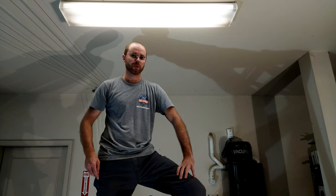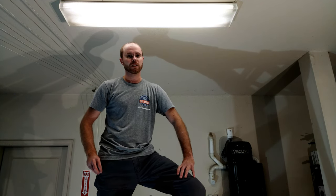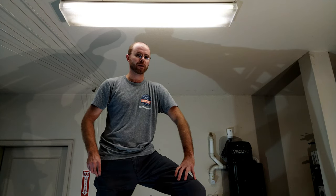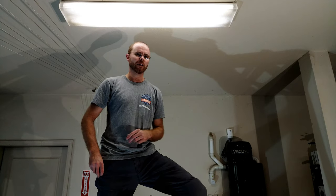You might think this is as simple as just changing a light bulb in your regular home socket, but it's not. These fluorescent tubes require a specialized device called a ballast to modulate and start with a high voltage. I'm going to take you through the concept in just a minute and then we'll redo the electronics on this so we can swap it out.